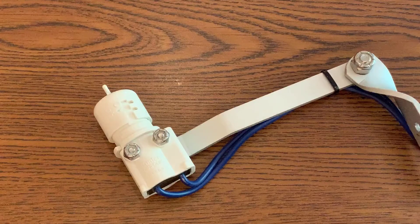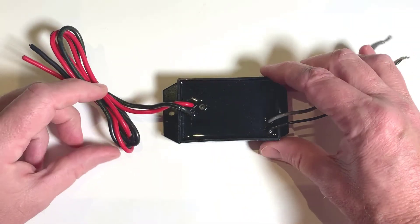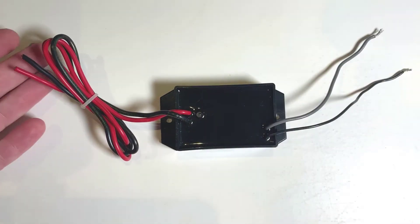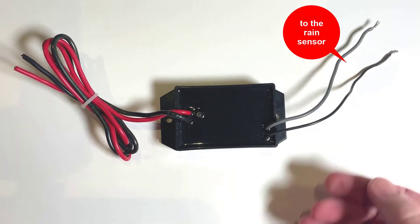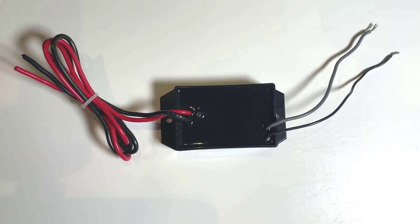Maybe you want to customize rain sensor settings even more to your liking. Event switches combined with start-stop-pause conditions can help. I'll use that same wired rain sensor, but connect the sensor leads to the gray and black leads of an event bicoder. After that, I'll connect the two-wire leads to my two-wire path, or if I have conventional wire, I'll just install the bicoder inside the controller cabinet.